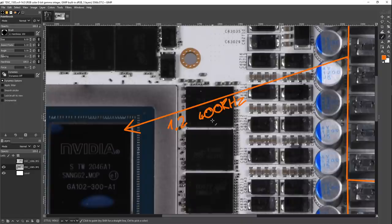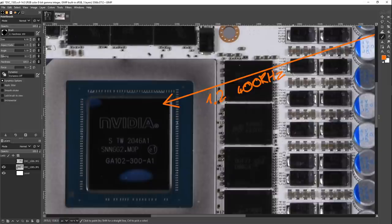You would almost certainly want to run the VRM on this at a higher switching frequency. Not necessarily 1 megahertz, but there's a point of diminishing returns — if you keep raising the switching frequency, at some point the VRM just gets really, really hot, and if you don't get any benefit in terms of voltage regulation, you're just making your card hotter for no good reason. The monster output filter on this card could help in that you might not need as much switching frequency to hit the same level of voltage regulation. If you haven't hit the point of diminishing returns yet, you can combine very high switching frequency with an insane output filter for probably some of the best voltage regulation on any 3090.